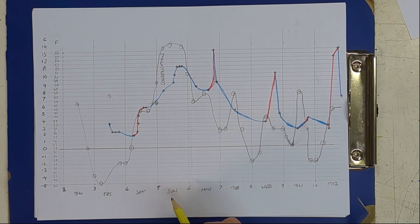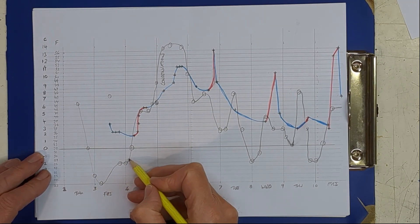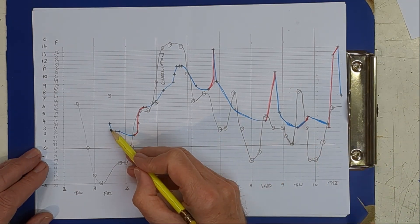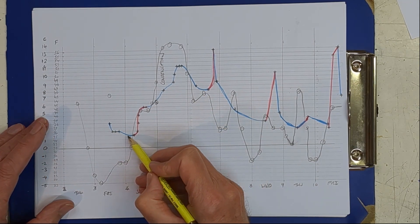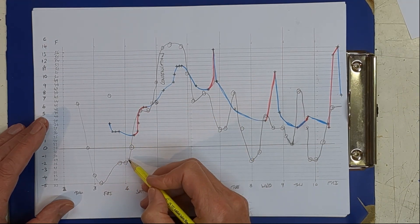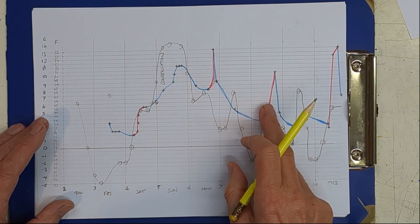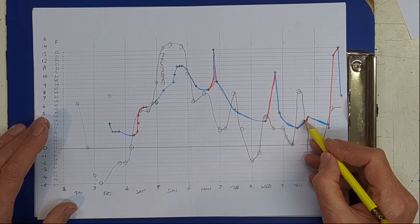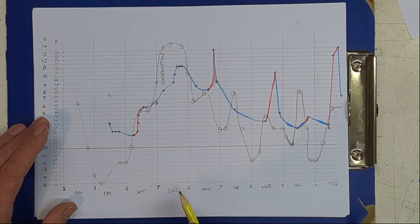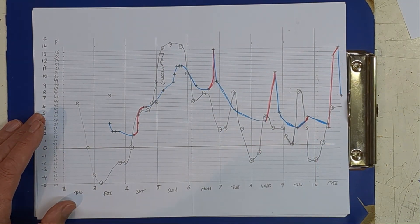This is a graph showing the ambient temperature for where we live — that's this pencil line here — and the temperature in the workshop shown by the crosses, represented by blue and red lines. The blue lines represent when the heating is off and the red lines represent when the heating comes on. Whenever I operated the heater the temperature went up in the workshop, and I operated the heater five times in the past week. It's interesting that Sunday was when I recorded condensation in the workshop and indeed outside on the rear door.